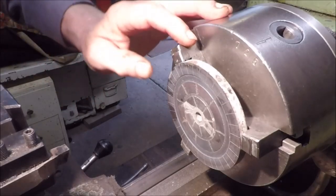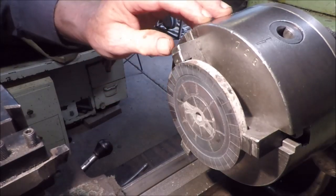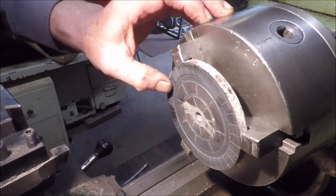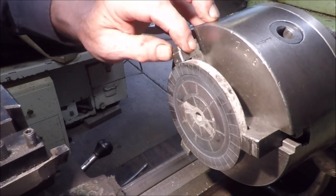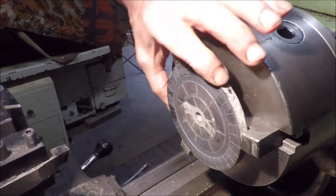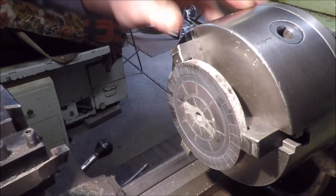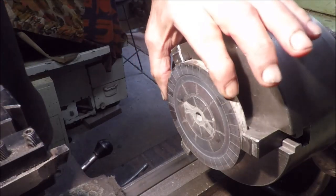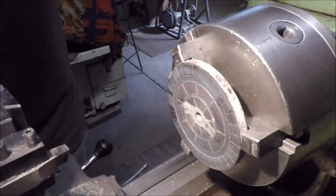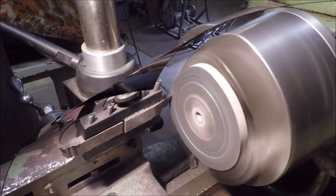I've decided that the 32 slits for the gas to come out may be a few too many, so I'm going to remove these — just face them off in the lathe — and cut another 16 instead. Nothing very special about any of this; the whole thing was made with pretty ordinary lathe work. I've got this part of the degassing head set up true in the lathe and I'll simply face off the existing slits.